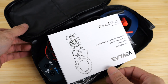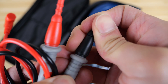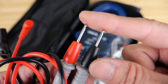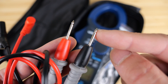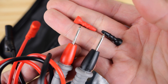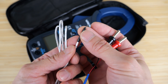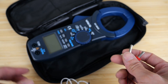Very simple packaging. It does come with a little case, instruction manual, and test leads — they are covered so you don't poke yourself, but I feel like I can easily lose these little knobby things at the end. In my experience, this is not so sharp; sometimes you can get aftermarket leads that are much sharper, almost like a needle. This does feel sharp, but I don't think it's absolutely necessary to cover them all the time. I really like how it comes with a temperature probe — it's just a wire that connects to dissimilar kinds of metal, and when heated there's a voltage difference. There's also a little hand strap.